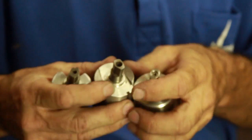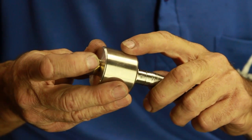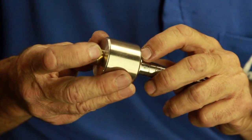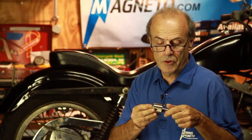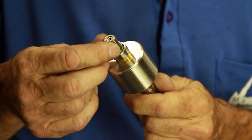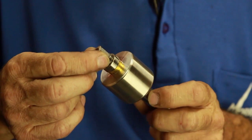Nowadays, we don't use Alnico — we use rare earth magnets, which are about twice as strong a material. We still have magnets that go all the way through, but we put them inside a stainless steel shell. The stainless steel shell is welded to the shaft, and we pot the assembly in epoxy. After it's cured, we turn the unit and put on a stainless steel cam, which we polish because you need long life out of the rubbing block of a set of points.